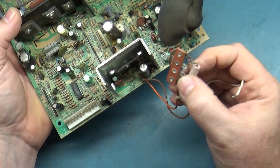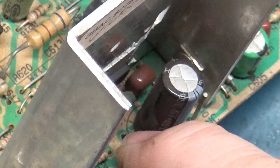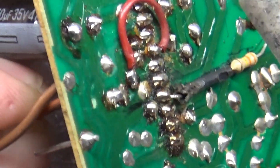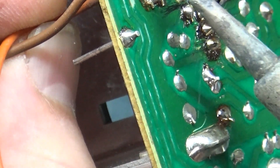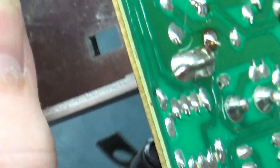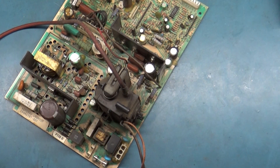That pretty much prevents these wires from busting off. A couple of the wires are already broken off here. I think what I'll do is just go ahead and remove this and fix it up later. Let me note: orange is inboard. I don't think it actually matters because it's going through a resistor, but orange is inboard. Okay, so I have those wires out now and the sweep mod removed — we'll set that aside and fix it later.